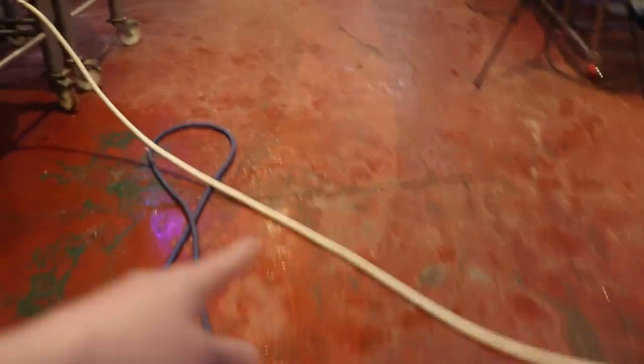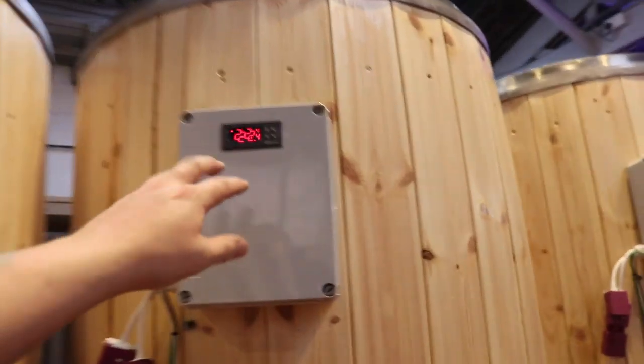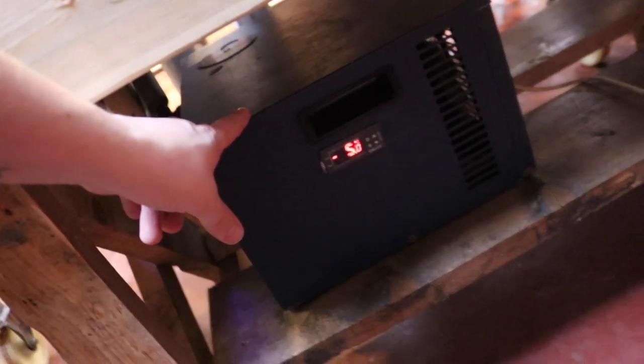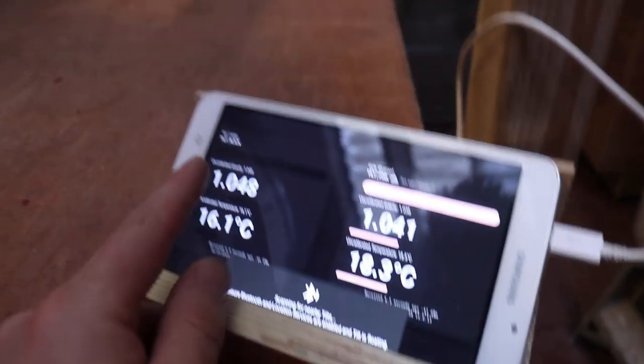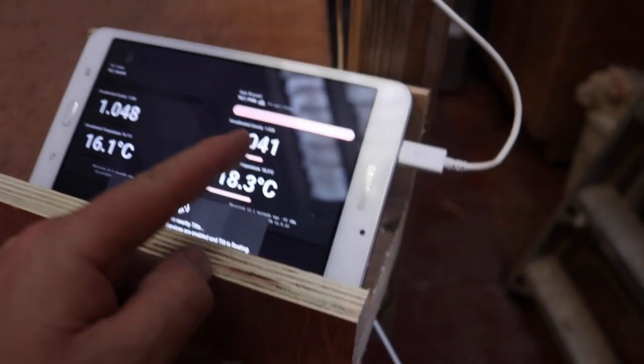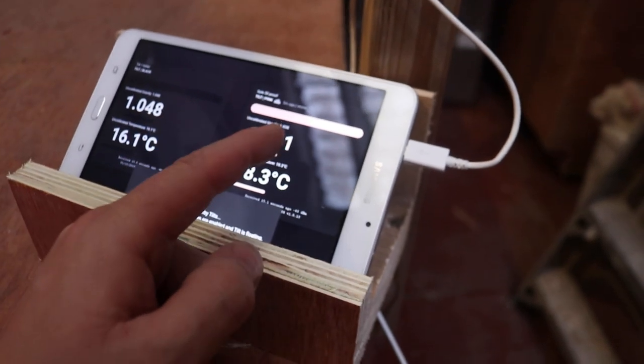We're transferring via this white dairy hose into tank 7, and it's sitting at 22.4 degrees at the moment — that's a nice temperature for us. Round the back here you can see we've got this corny cooler: this Maxi 310 is controlling tank 8, this Maxi 310 is controlling tank 7 that we're filling up, and just here we have our tilts. The tilt black is reading the gravity in the pump water, and the tilt pink is reading the gravity in the proof of concept that we made yesterday, which is in that tank there.